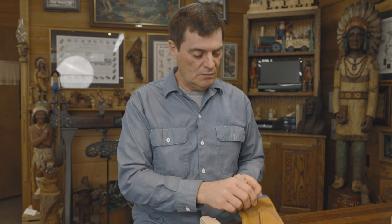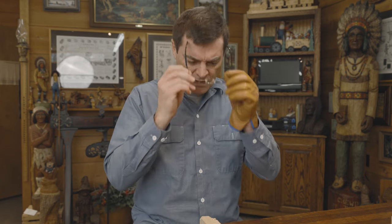Hi folks, welcome back to the channel. Today we're going to be doing a teeth carving — carving teeth on a piece of wood. We're not going to do any eyes, just creating the nose area, then coming down and creating the roundness of the mouth and putting some teeth in there. Whenever you're carving teeth, think about what's behind the upper lip, making sure it is rounded, because that will keep you from having flat faces. Keep this dental mound very rounded when carving an expression, whether it's got a mustache or a full set of teeth.